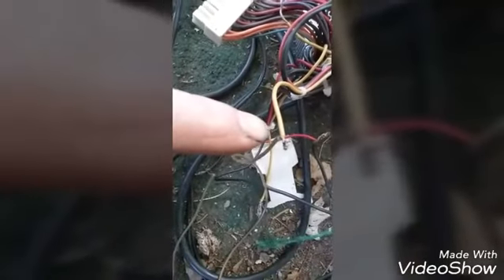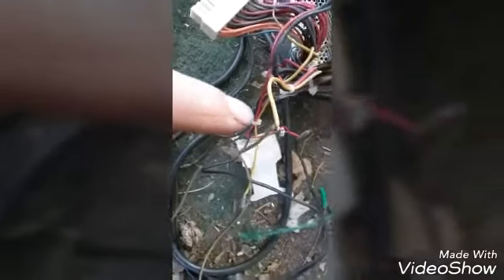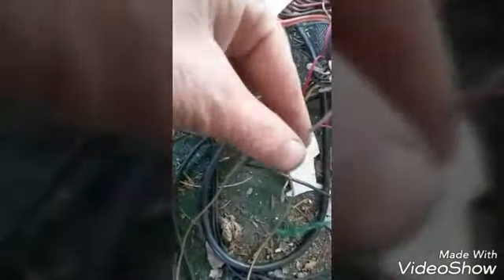I have to do some trimming with wires and stuff to make everything fit on my board. The fan is on 12 volts, which is like 11.78 volts, and of course the ground. I have them both connected — this wire goes to the motor, this wire goes to the fan. The ground, the red is the hot five volts that goes to the motor, and the 12 volts goes to the fan.